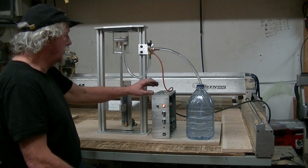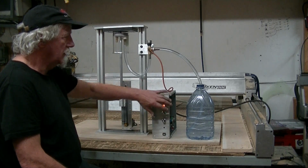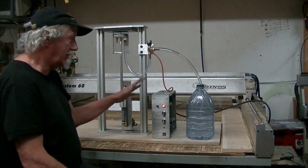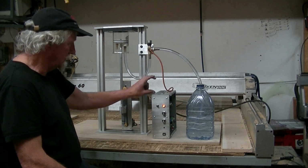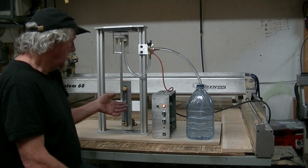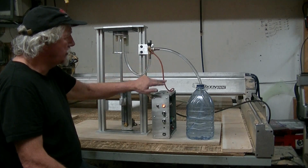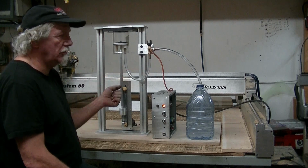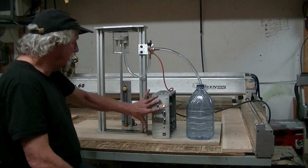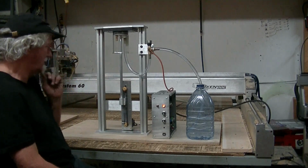So it'll be battery backed up, because this board will have a sensor in it as well to monitor the pressure. But if the power failed on this and you didn't have a battery backed up secondary watchdog circuit, then it wouldn't know. So the way to do it is you have two circuits monitoring the pressure, but the second one will just be an analog circuit, a simple comparator circuit, and it's battery backed up. So if this fails, then the battery backed up circuit sees the pressure doesn't change, it sounds the alarm within 2 seconds.